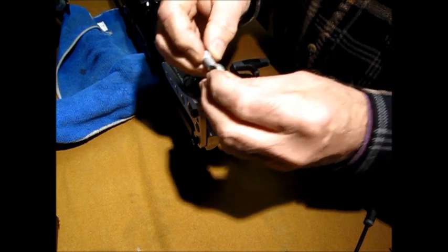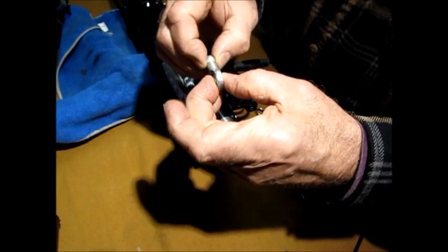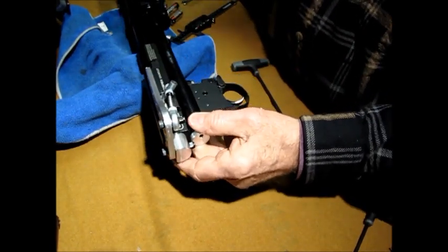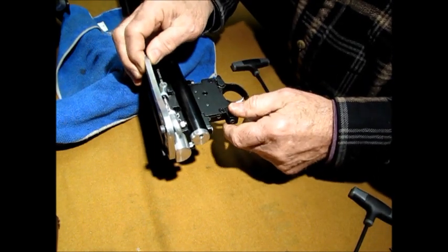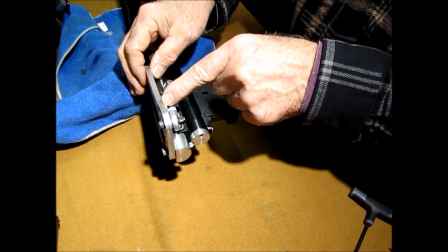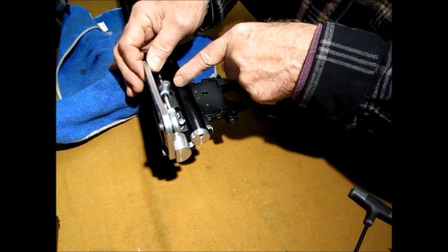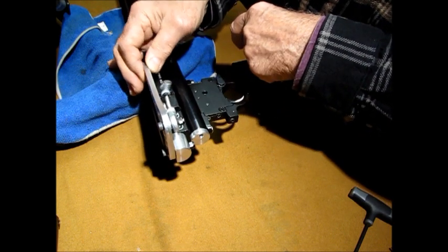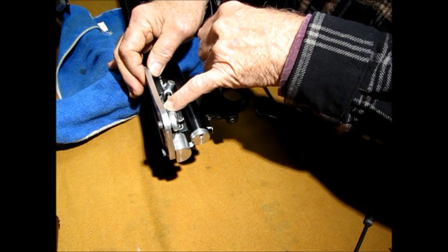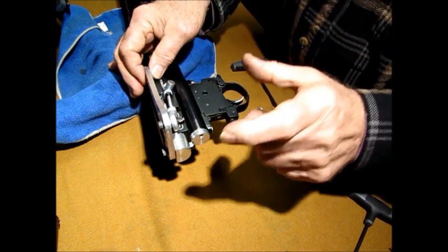It's going to bump this thing, and when it bumps this edge, it screws it down. See, it just moves it right down. Same thing right here. When it gets to this point, just watch, see? As you pull your lever out, this bump screw goes away and disappears on the other side of it, and that's when you bolt. See, that's what moves it right there. That makes sense? And if it's too tight or too loose, you can put a little shim or a washer under here to make the tolerances a little bit tighter.